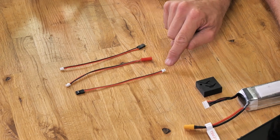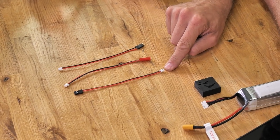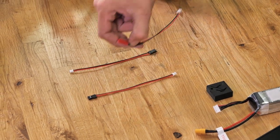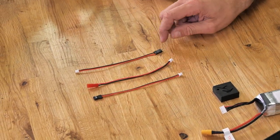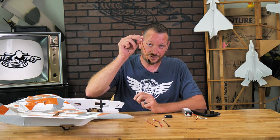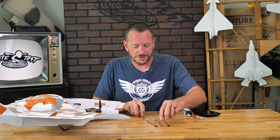The way that we're going to power the FTEZ-ID is through the three connector pigtails. On one end of each connector you're going to see the PH-2 connector, and on the other end you're going to see either the JR connector, our battery lead JST, or our balance lead connector. Let's first start with one of the easiest ways to mount this using something as simple as an extra servo extension and our servo lead connector.